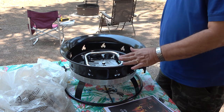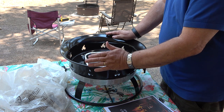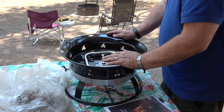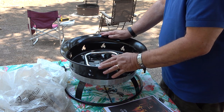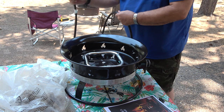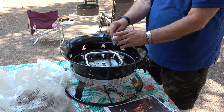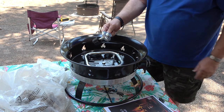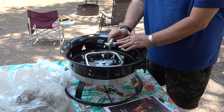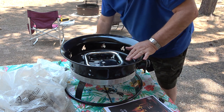You can see here in front of me there are a couple of bags of rocks — two bags of small rocks, one large bag of rocks, and then another bag of spare rocks. Those are going to go in the bowl. There's no assembly required really for the fire pit — the burner's attached, the fire pit's here, and the hose with the regulator is here. There are some good hints in the owner's manual about the flow safety connector in this regulator — you want to make sure the valve is off and it recommends turning the propane tank on slowly so that the high flow safety sensor doesn't trip.